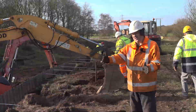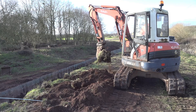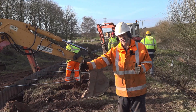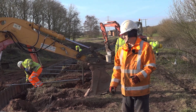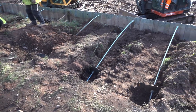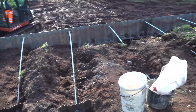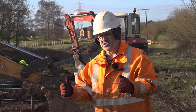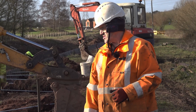What we're doing here is we are digging out very carefully between what was two-meter center and two-meter-long tie rods. We're then adding intermediate tie rods and longer tie rods — creating three-meter-long tie rods with anchor poles at the back, putting them roughly every meter.